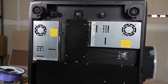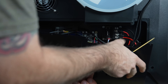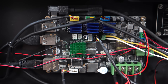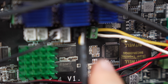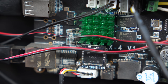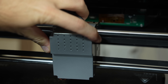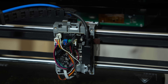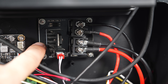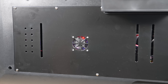Under the printer are two 450-watt, 24-volt Meanwell power supplies — it was good to see quality power supplies on this machine. On the back is a custom Makerbase Skipper board, which has both the Klipper host installed and a separate MCU for controlling all the printer's hardware. The printer uses an MKS eMMC module for Klipper instead of a micro SD card. There are three TMC 2209 drivers on the main controller, and a separate toolhead board containing the extruder driver. That toolhead board also has an accelerometer for input shaping and connects to the main board over USB-C. The controller fan is wired to an always-on port, so even when idle it runs at full speed.